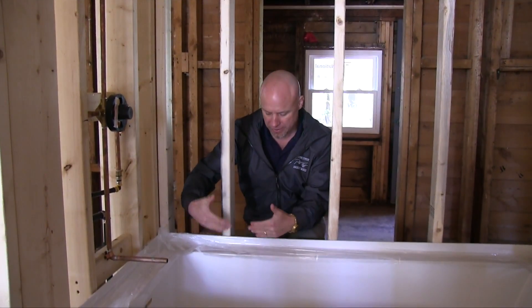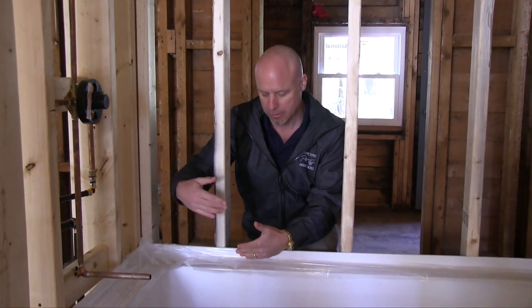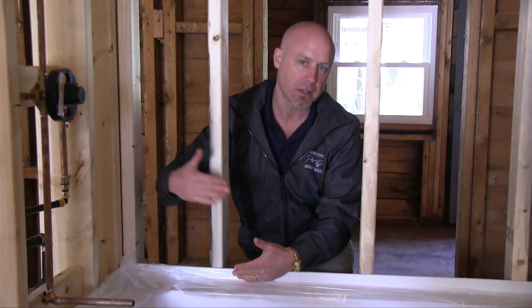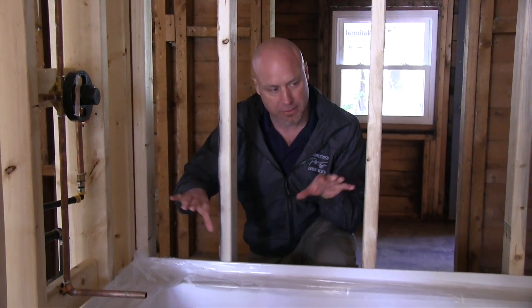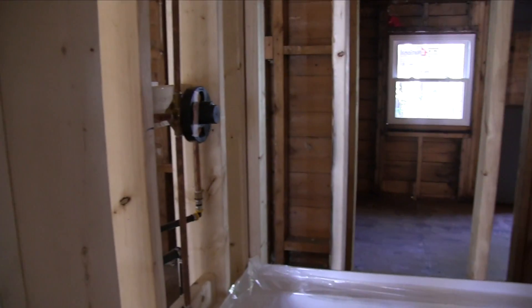You'll see when a tub is roughed in there's a raised lip, and tile backer board and then tile — or whatever we're going to use for a tub surround — comes down over this. It makes it virtually impossible for it to leak above this lip, around, and below. A lot of people don't see that, but it's nice to see everything at the roughed-in stage. The after shots here will be a lot of fun too.